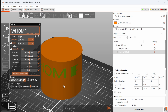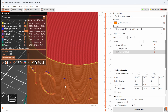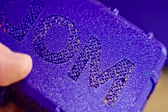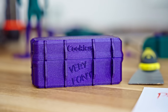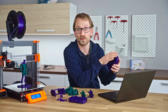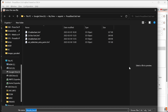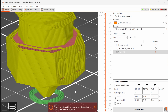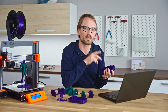Right now it only does a straight projection, so if you add text around curved surfaces it's only going to look good if you don't go too close to the edges — that's the big limitation. You can also use the text geometry as a modifier, so you can have the infill just poking through for your lettering if you want. One concern was that you'd have to redo the text setup whenever you updated your design in CAD, but if you save the entire thing as a 3MF project out of PrusaSlicer, you can come back and simply swap in your updated STL, and as long as the origin didn't change, it will apply all the modifications to the updated model. This is essentially a part of CAD you're now outsourcing to the slicer.